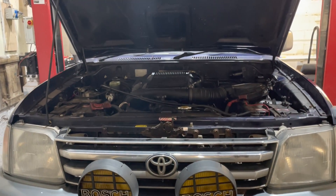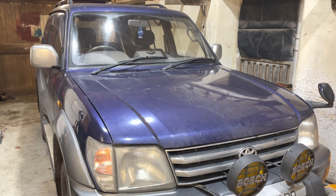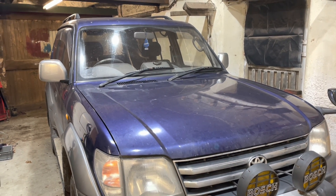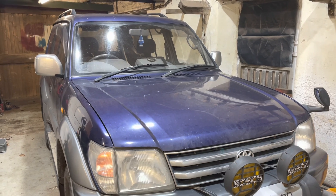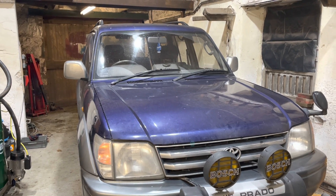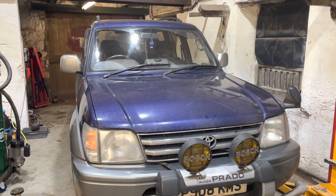Got her fired up and she seems to be running all right. Only problem is I forgot to put the fuel return line on, so I've made a bit of a mess. I took it on a quick run and the engine's running a lot better. It was still stuttering but at much higher revs, which I think is because of the straight waste veg oil. I'm going to dilute it with a bit more diesel to make it flow easier through the pump. Cleaning the injectors has certainly helped. Thanks for watching - if you like the video or have any comments, leave them below and don't forget to subscribe.